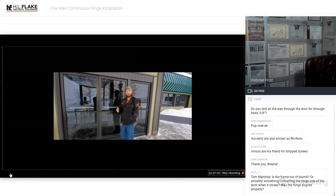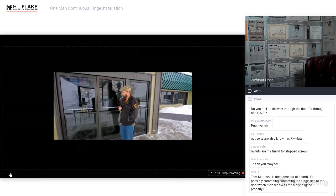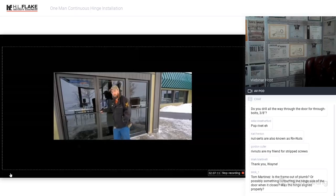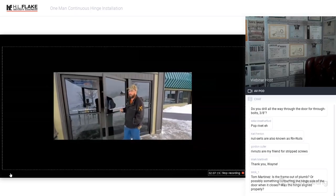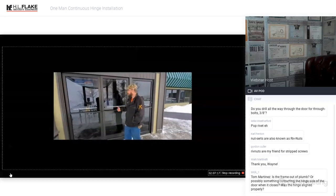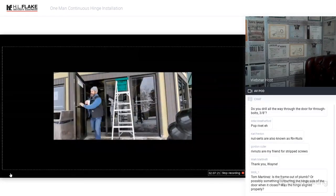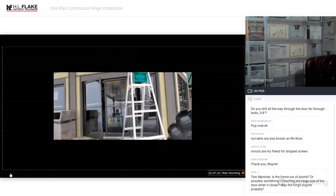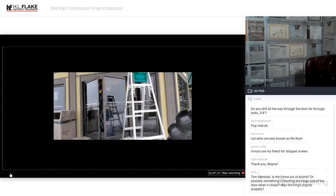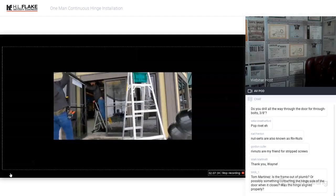Anytime you do this, you want to check with your local fire code, your fire marshal, and building inspector. But for the most part, this will be a really nice solution. It should last a lot longer. You can see these closers are all blown out, so we're going to fix that. Here you can see that we begin the process. We're going inside, and your center hung or concealed door closers will usually have a side arm or a rear arm attachment.